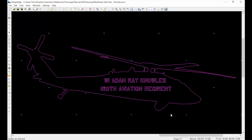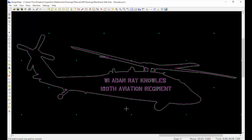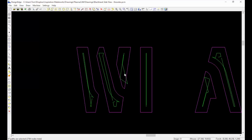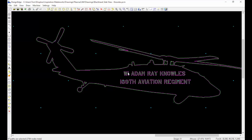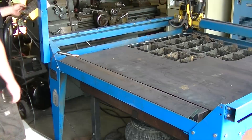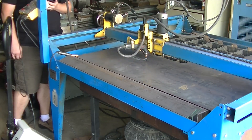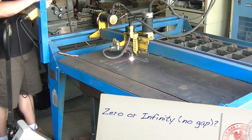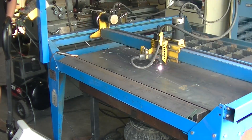All I have to do now is click OK. I haven't put the cut paths in yet, so I'll automatically convert and clean up some of the cut paths before doing any cutting. Watching it in fast forward, it's really evident that the height is going up and down. You can see it touches off to get its Z zero, and then for each cut it starts a little high at 0.15 inches, then drops down to 0.06 and does its cut.